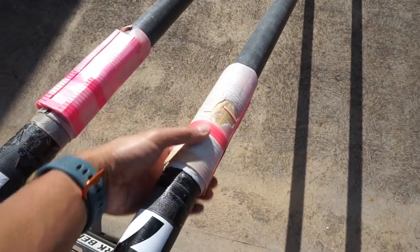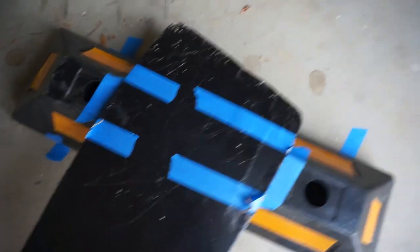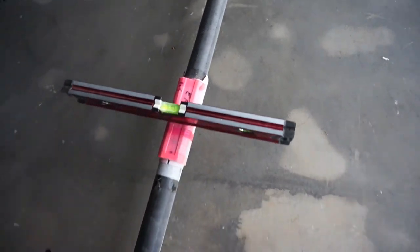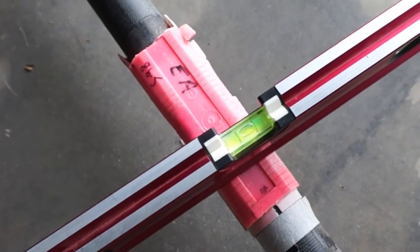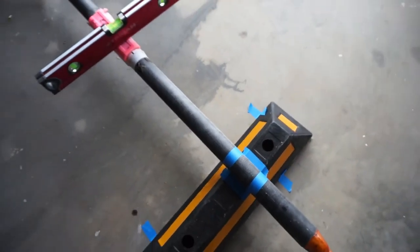It's a chilly foggy morning and I'm doing the sleeves today. I've got the oar set up on two rubber blocks with masking tape to mark the exact position. I need to make sure the flat part of the old sleeve reads zero on a spirit level so when I put the new sleeve on the rotational direction matches. That's why I've rigged up this positioning system.